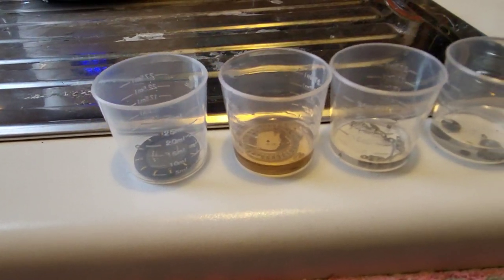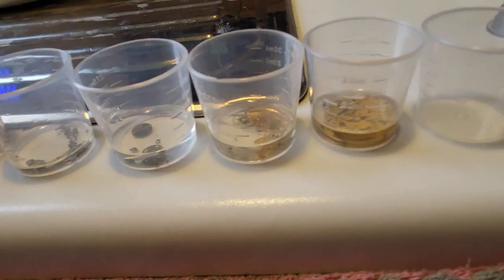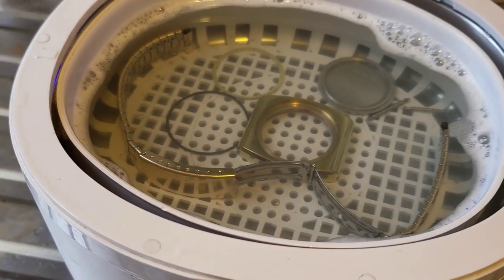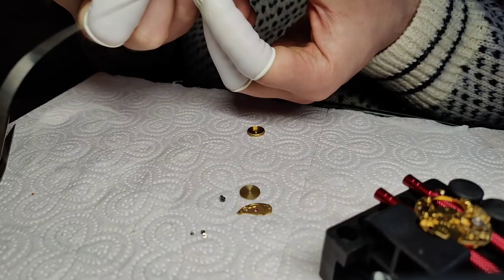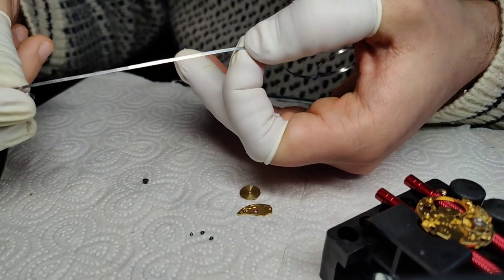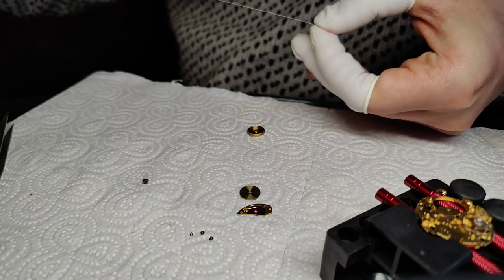For the cleaning of this watch, after last time's event where everything went down the pan in the ultrasonic cleaner, I'm going back to what I know — resting everything in 99% alcohol. You can see a staggering difference in all the different colours from the amount of oil it had pulled off. The watch is clean — it's time to get it reassembled. First things first, I'm going to get the mainspring put back inside the barrel.